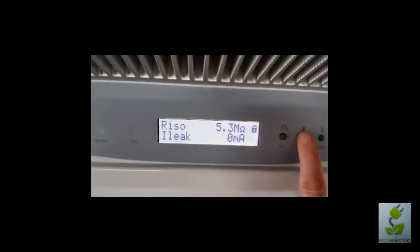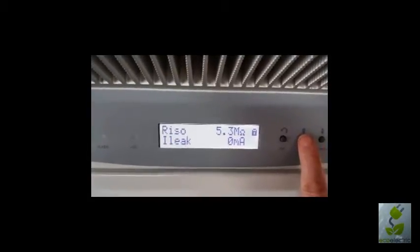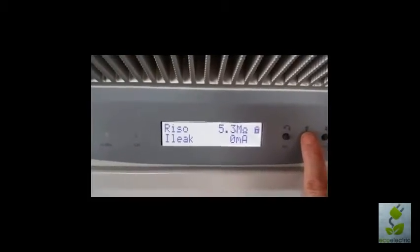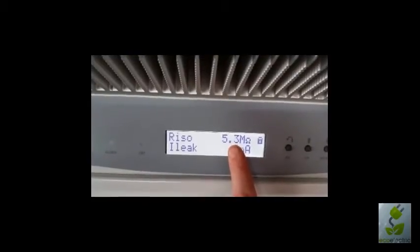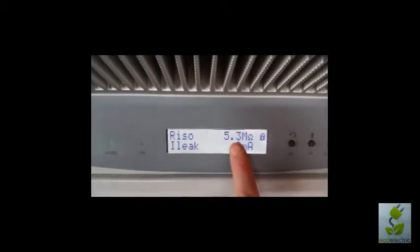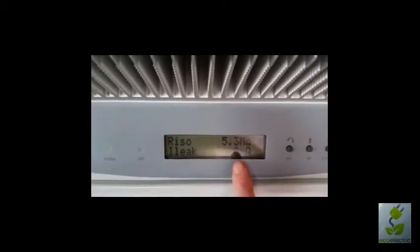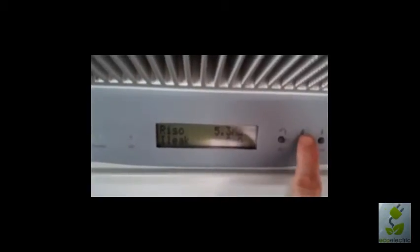This one here can occasionally cause some problems. This is an insulation reading on the cabling in the system. ABBs and quality units perform that test automatically at a regular interval. You will generally see this figure drop down in wet weather — it's a very variable reading that changes quite dramatically based on humidity. We're looking for a reading over 1 megaohm; this is currently 5 times that. Anything over a megaohm is going to have an isolation current leak of 0 milliamps. Once we start dropping below 1 megaohm, the unit will go into alarm and we would see that figure increase.